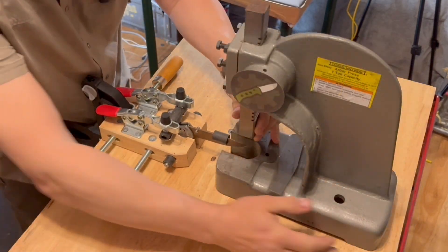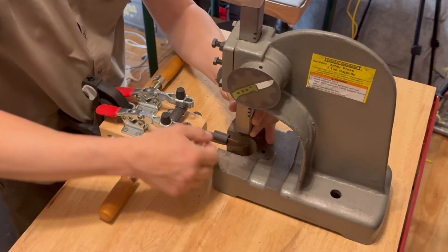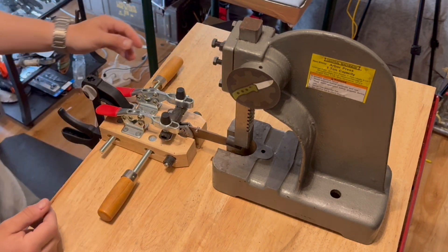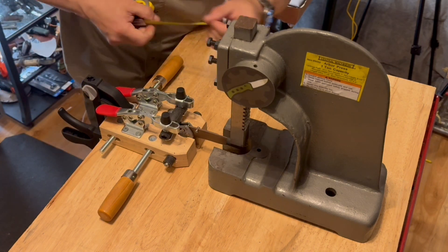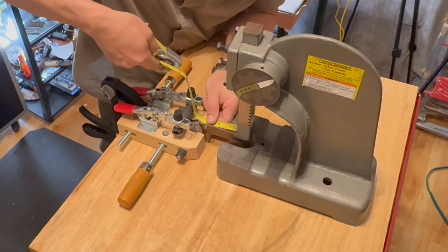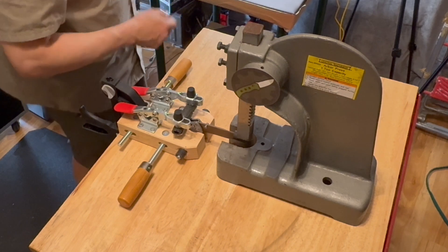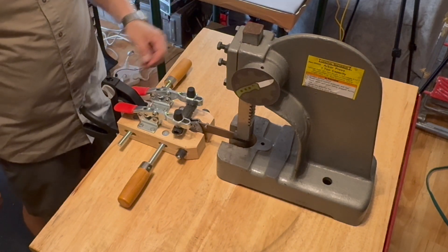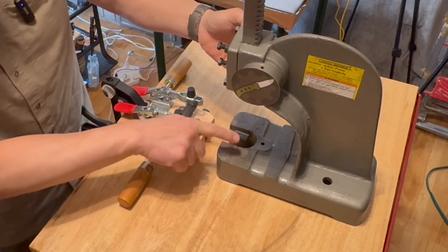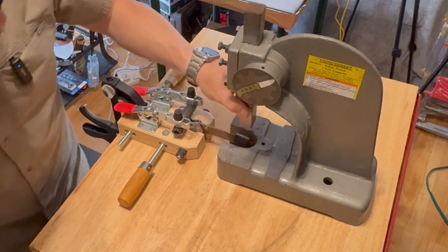On my channel, all knives are looked at as a system, and the system intended for human use has to be safe. This device determines whether a knife can withstand a striking force of a fixed value on its spine. The distance between the pivot of the knife and the place where the ram strikes it is 3¼ inches. The ram is a solid block of steel weighing 2½ pounds. The striking distance is 6 inches, and the ram accelerates from 0 to 3.8 miles per hour.